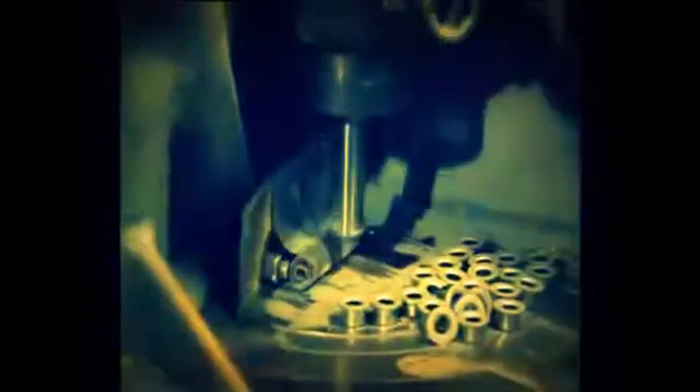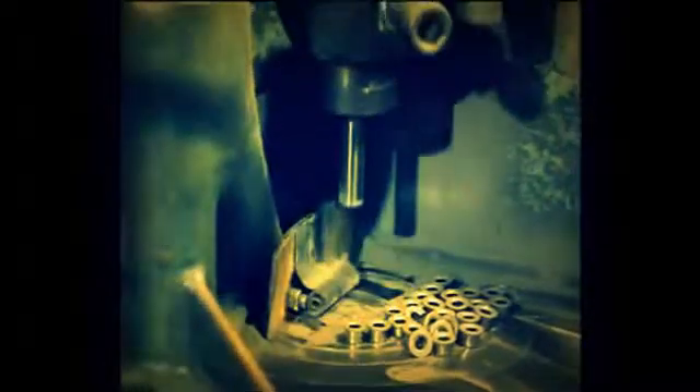In mechanical pressing, the powder is automatically gravity fed into the die of a mechanical or hydraulic press and consolidated to a specific density. Pressures of ten to sixty tons per square inch are created by the vertical action of an upper punch, or by the double action of an upper and lower punch. Pressing is typically at room temperature, although elevated temperatures can also be used. Core rods are used inside the die to control formation of holes parallel to the direction of pressing.